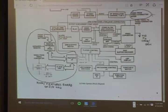It's in, like, when I show you the basic maintenance now. On any 400, it's something you do. You won't see it on a 300 or anything lower, so you just forget about it. But on a 400, it's part of the basic maintenance. It stops that, if you've ever had a 400, you turn it on and the screen looks wavy or bleeding. Instead of where it says please load disk, it's all weird and warped. It's the on-screen display, and it's not overheating. There was an addendum put out by RCA, right? Yep. And it's the contacts. You just clean the contacts with contact cleaner between the plug and the post, and you work it on there like four times. Every time, I've not had it fail once. As weird as that sounds.